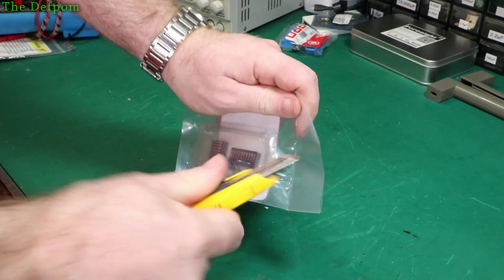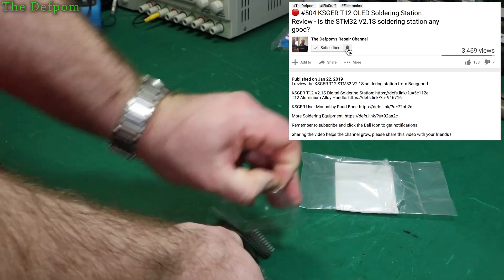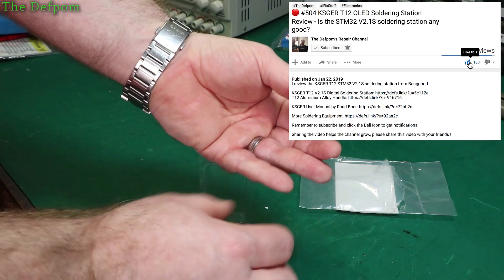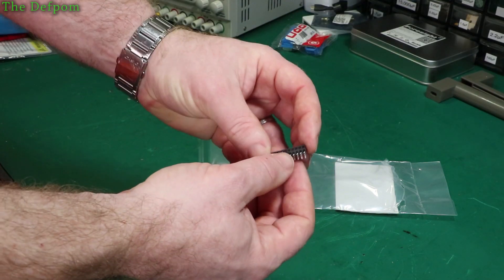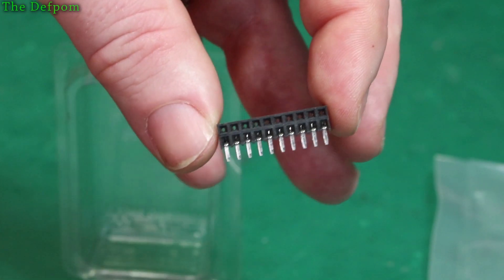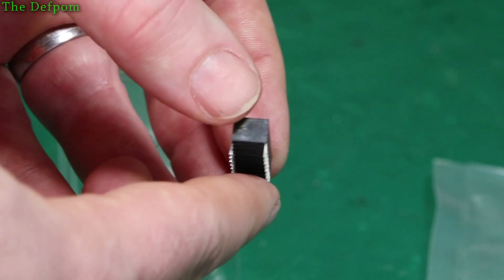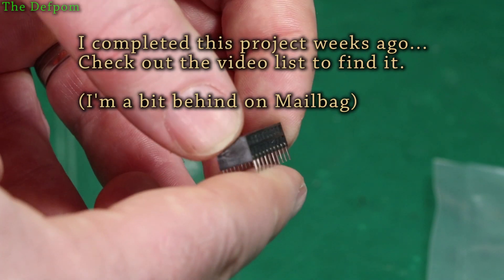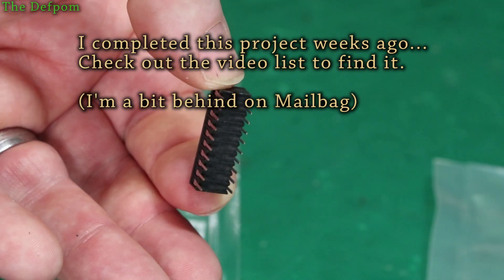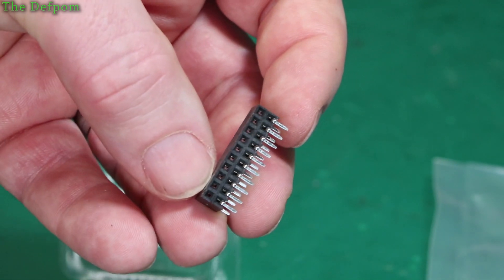I need a real knife for this. These are basically a DIP-20 package style size, and these are for header pins. You can see the pin holes there — you just get the header pins that go into there. So this is like a side-mounting connector. The reason for this is for my riser cards I'm making for the HP 8648 and 8647. I've got the PCBs on the way — well, they're actually here. We're going to do that in the mailbag as well, and that's part of the assembly we're going to be making.